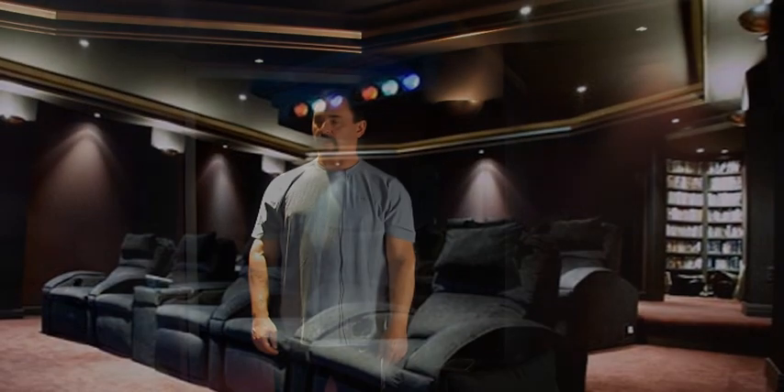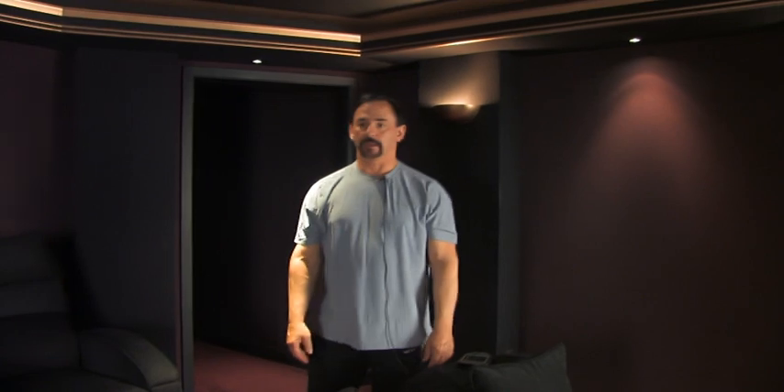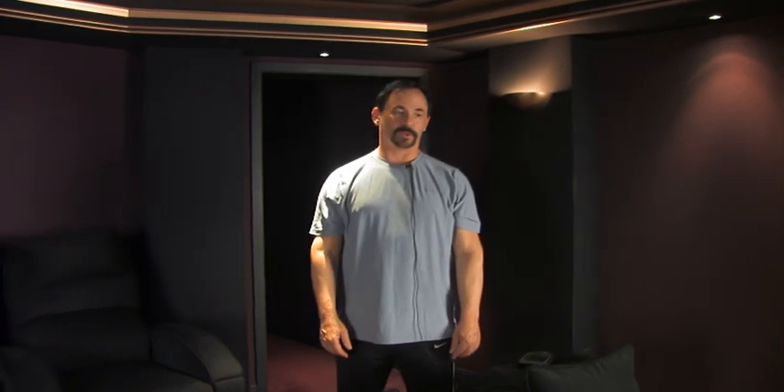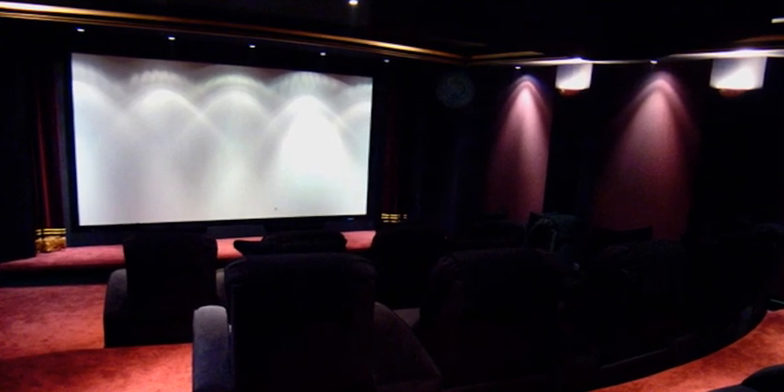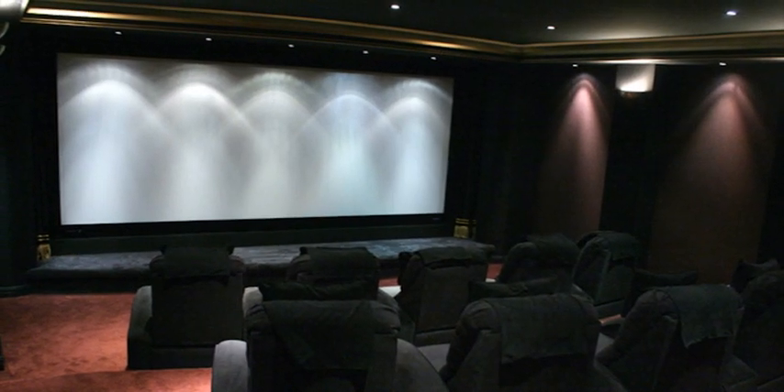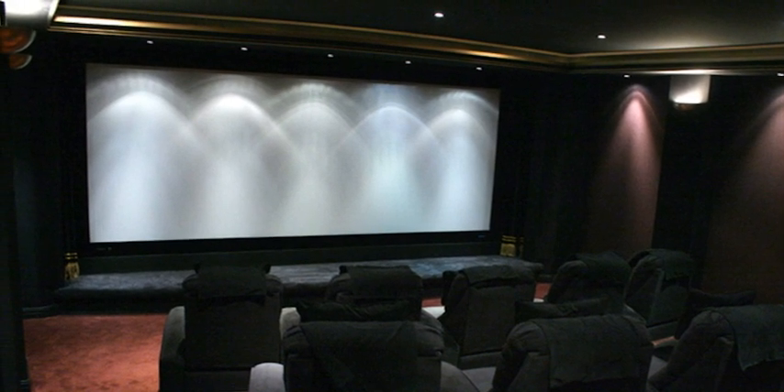Four and a half years ago I made the decision to go to a digital projector and get the CRTs out of the room. The idea was I could get a much larger screen with a lot more dynamic light output, all the resolution I'd want, with uniformity across the screen that CRTs couldn't compete with. It also allowed me to have the scope aspect ratio screen — the 14-foot Vistascope — with enough light output to illuminate that screen at about 20 foot-Lamberts.